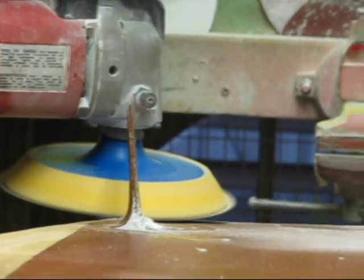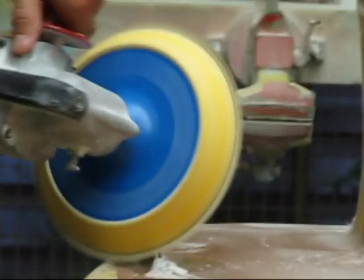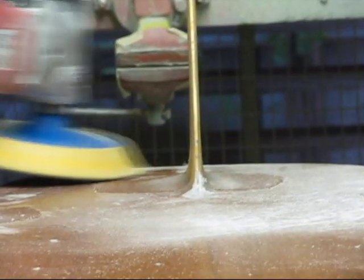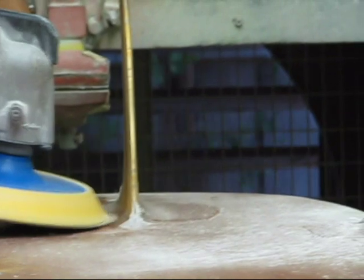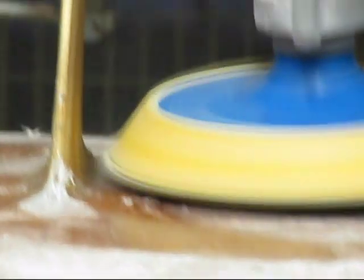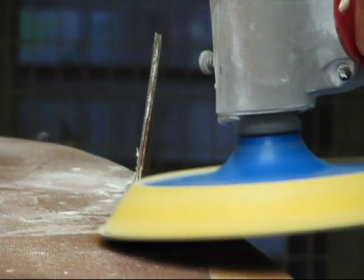I'm using a hard pad here with about, I think, 36 grit, 40 grit, something in that range. I noticed the colors of the discs you were using. You had a white one and that one, and the different grades of density to the pad. All grinding's done with a hard pad because it tears. The softer stuff is more for the finer grits, polishing out.